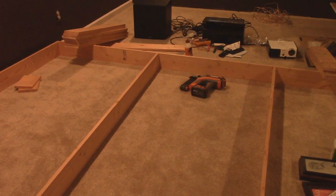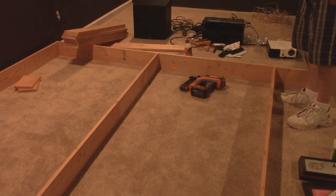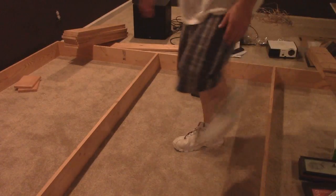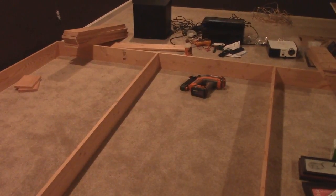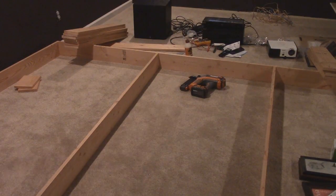What I've done is pretty much exactly what I was talking about. I've got my piece down here as the base, and under the base I put a one-by-four as a toe kick — it'll make sense when I raise it. On the outsides I've got my six-foot-six, and on the insides I have six-foot-six subtract an inch and a half, so when I throw the top piece on everything will fit.